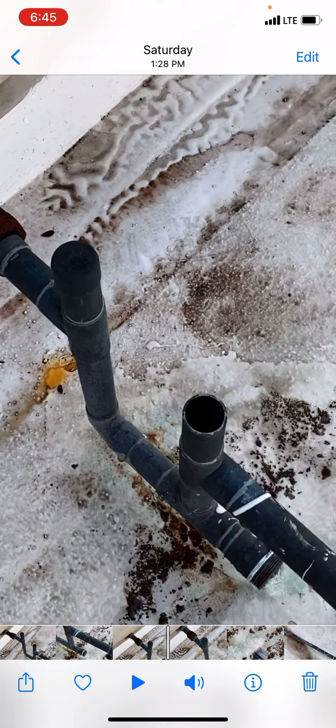So finish it off by putting a little pan tablet in there. Normally I wouldn't do that, but this is on a PM and I had that in my bucket, so I went and just threw it in there to make sure we didn't have anything block up after we're done cleaning these evaporators.